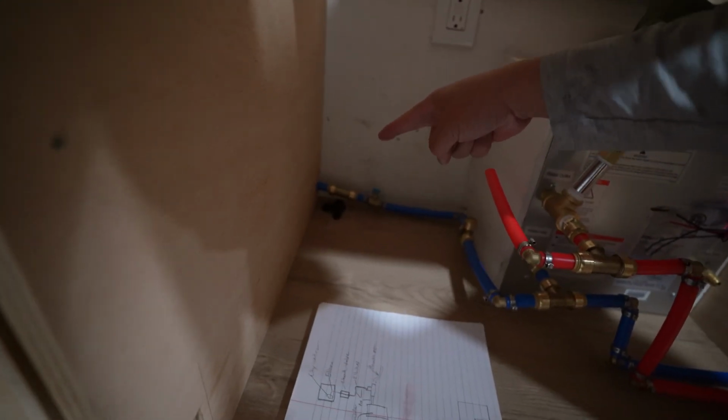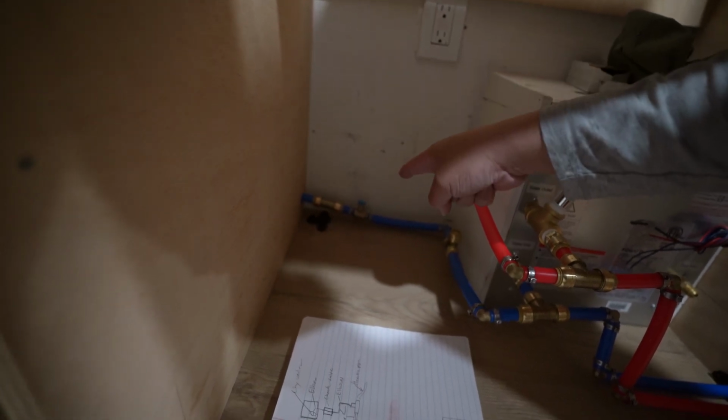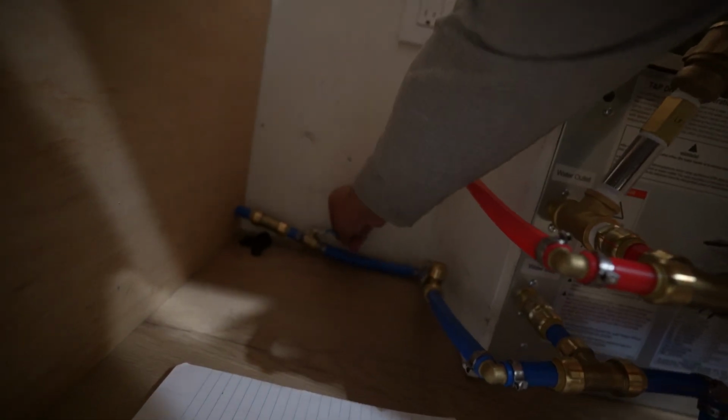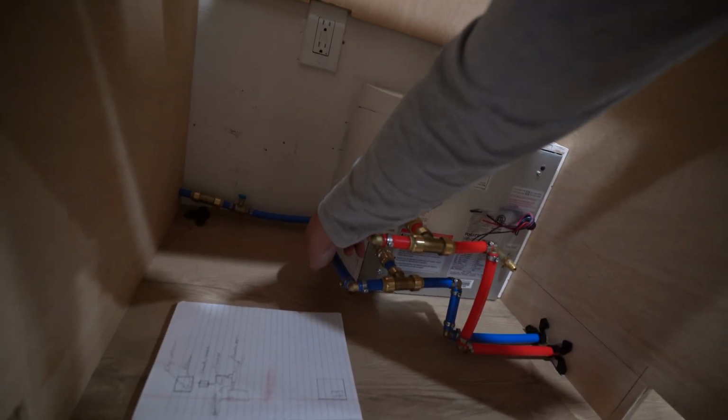And since we're gonna be going to colder climates, I am gonna be putting a 1/2 inch piece of insulation under, which will make it level to the pump itself. So moving along, we have the check valve right there, and we have this ball valve just in case I need to work on this. I could turn that off, and if it's good to go, then I could just boop. There it is. Cold water is going to run through. It's on this T connector right here.